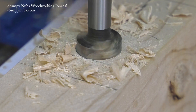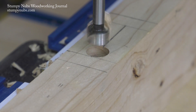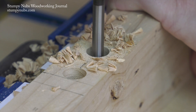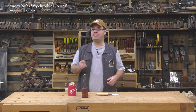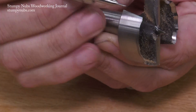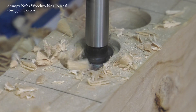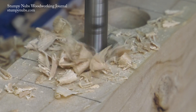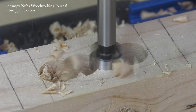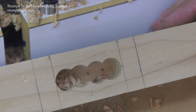And don't forget to set the depth stop. Bore the first hole close to the end of the mortise — you don't have to hit your mark perfectly. In fact, I sometimes intentionally bore just a little bit inside the line. After boring the first hole, move to the other end of the mortise and bore that hole next. Now you can remove the waste in the center by boring overlapping holes. To do this, you have to have a good Forstner bit — it has to be sharp and the guide rim has to be well designed so that it will bore straight down and not drift into the open space in the hole next to it. The point of the bit also has to be in contact with the wood at all times right on your line. That's why we bored holes at the two ends of the mortise first — now when I get down to the last narrow little bit of material, I can still put the point of the bit on some of the wood.